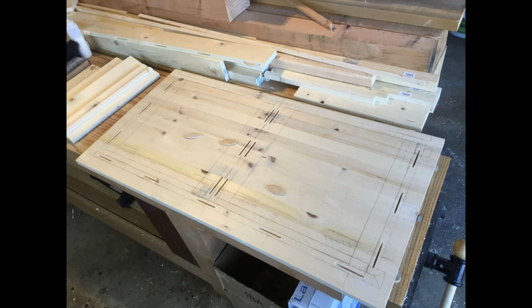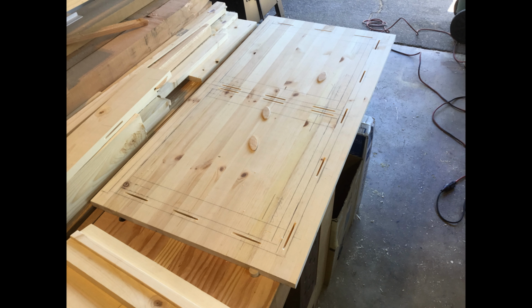So in this sense, it's very nice, and it's neat and clean. No visible fasteners by any means. It's all glued together. And again, this could be done with dowels, if you're trying to get away from using any kind of visible screws. There are other methods too, like more detailed types of joinery, or combining cleating with what you're working with, but then you get a little more involved. Other than that, this is a decent way of doing it. It's very simple, and if you're able to purchase a machine like this, which is not a huge expense, it would be worth your while, because you can use it in a lot of applications. It's a very good machine to have in your shop.